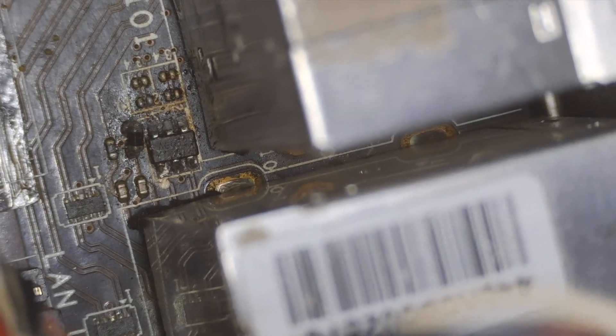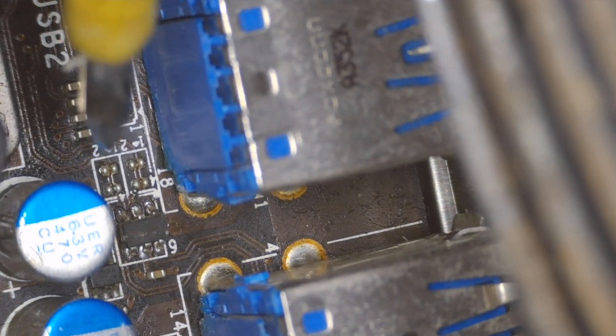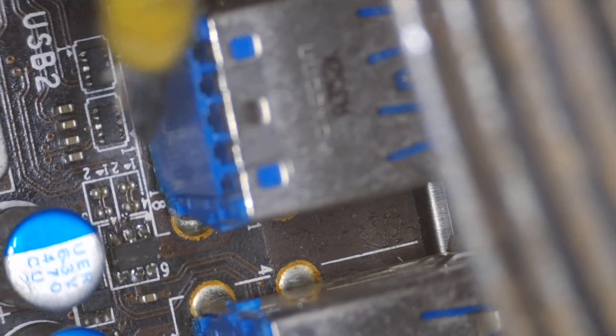You can see the protections are everywhere. I tried to remove this one as well because every external connector has these kinds of protections. Just remove the USB connectors one by one — these ones are for the display, these are for HDMI, and this one here is for USB. Try to remove them one by one, turn on the PC and test it. If it works, just change that mosfet — you can call it a protection.